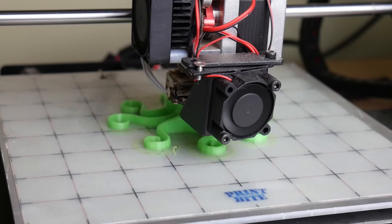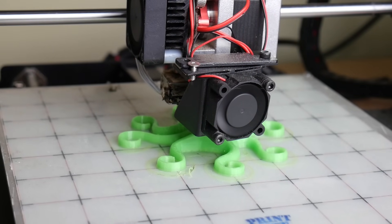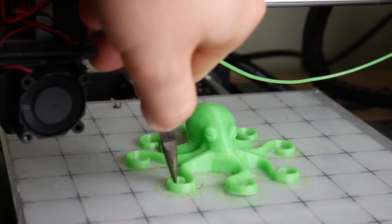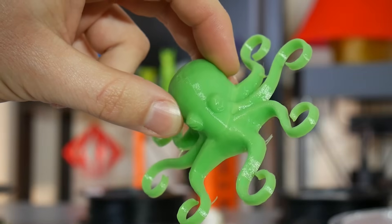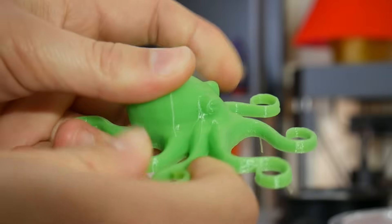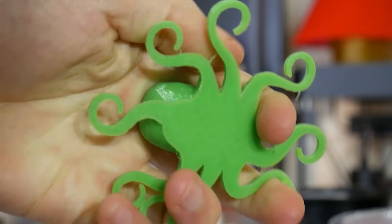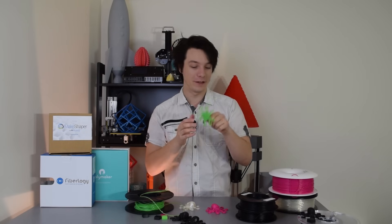Because this is elastic, printing it can be very challenging. I printed my octopus on the Flexion using the same settings, but a little hotter — 230 degrees C. TPU sometimes likes that depending on the brand. The quality was again fantastic, and I can definitely tell it's a lot more flexible than the Polyflex. It also has a bit of stretch and elasticity, which is interesting because it feels like such a wet noodle on the spool at 1.75mm. This is definitely something you want if you need something to be both elastic and flexible.